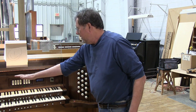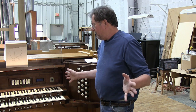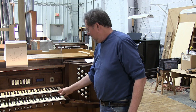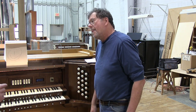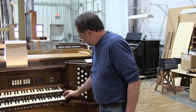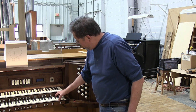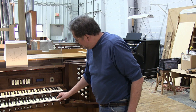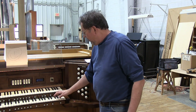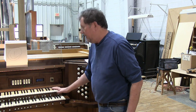So all those holes from the back of the keyboard to the front are all drilled at the same time. All the blanks are done at the same time. Then they determine, oh, this customer wants bone and ebony for keys. So for things like the bone, do you actually get the raw material and have to cut it to shape? Yeah, we get ones from Rhode Island, and we more or less have to inlay them. We have to put them together and sand them so they're a nice butt joint and clean, and then we route the edges, and they're all done individually. A really time-consuming process, done individually per key.